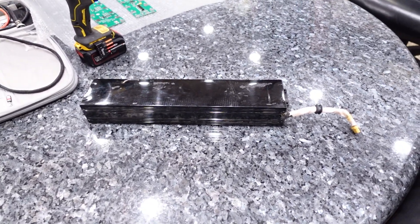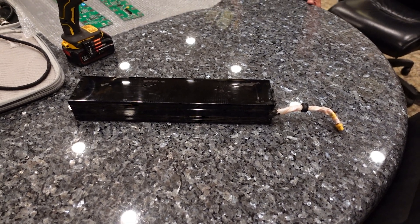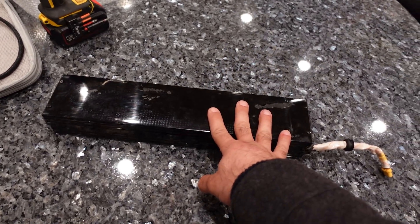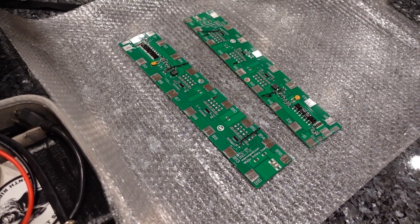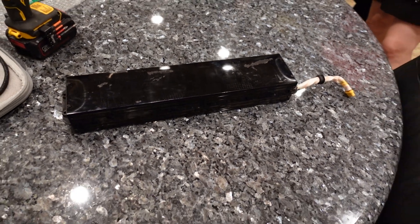Hello, I'm Roger and today I'm going to assist Brian Dillard from San Diego with his master battery that is throwing out some sort of error and giving him issues with charging. I'm being assisted by my two friends Joy and Celeste. I'm going to open this up and remove the BMS because the BMS will screw up my readings when checking the health of the batteries. I have backup BMS units if the cells prove acceptable, and I'll swap in the new BMS. If the problem is the cells, then Brian will need to get a replacement battery.